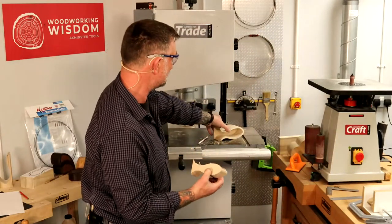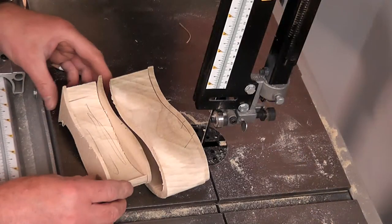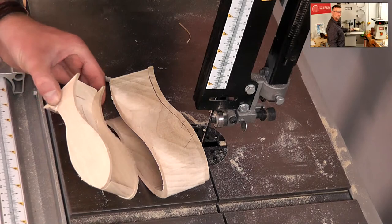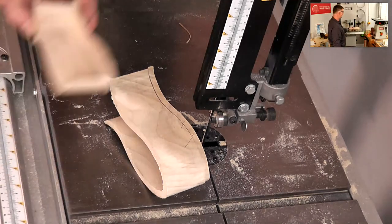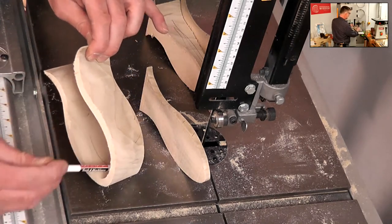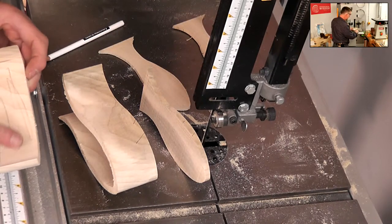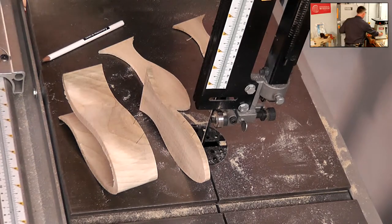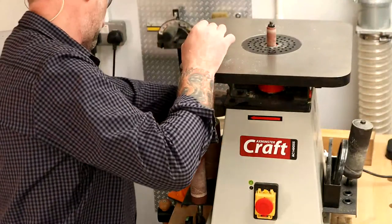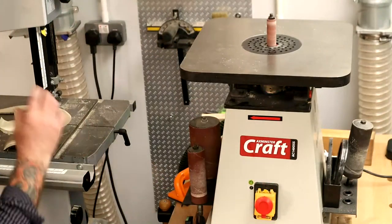Which goes into here. All right, let's get back onto that closer cam, Ben, if you would be so kind. All right. And we can clearly see when that's glued up, sanded up, that's going to go in there really nicely. But what I tend to do, as said, before I glue up, I sand these internals. Use a bobbin sander for that or just hand sand just to get rid of these occasional bandsaw marks. So let's go over to the bobbin sander very quickly and give that a quick demonstration. And then we'll look at some gluing up. Because the gluing up is important as well. So let's give that a sand on an internal.